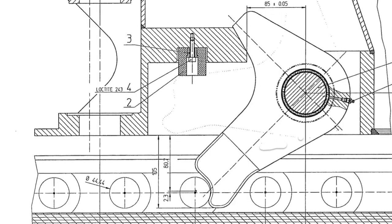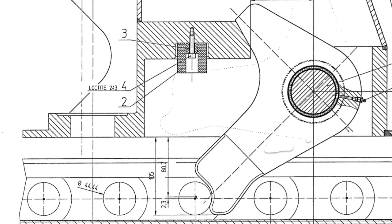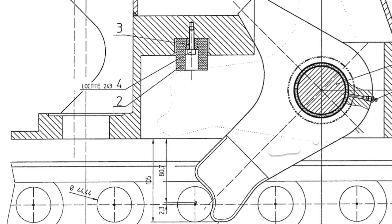Next, we'll talk about the chain dog. The chain dog is what's underneath the train that you're riding on typically. It's also called a ratchet. It could be called lots of different things, but most of the time when you're talking about chain dogs and anti-rollbacks, they're typically referred to as a dog. That's just the terminology that's used. But that dog sits there underneath the train. It can go up and down nice and free.